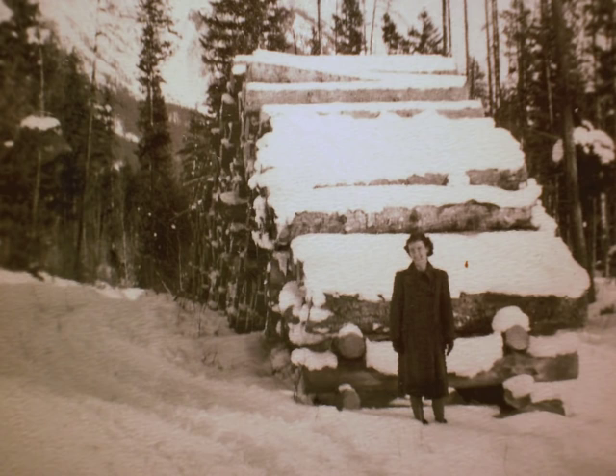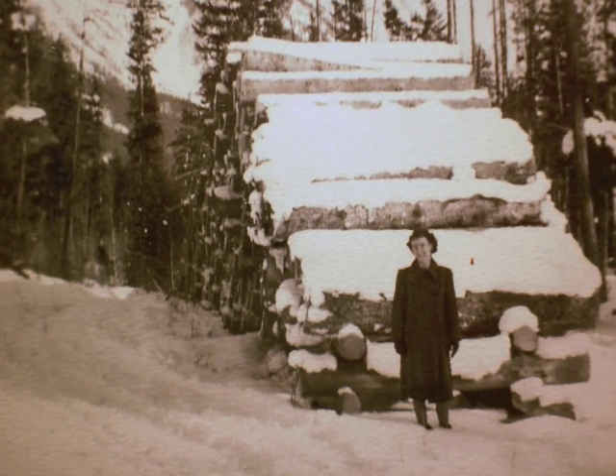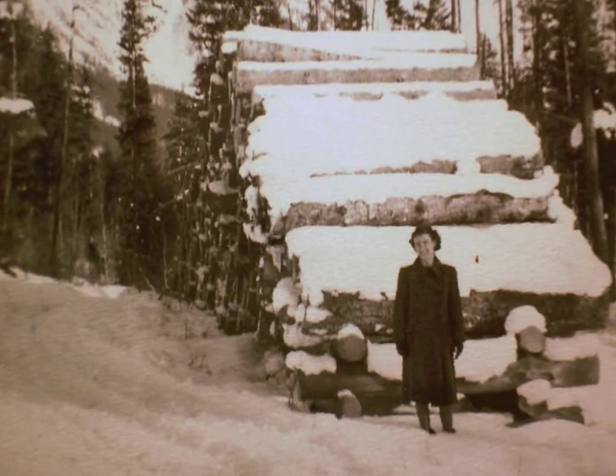But these are tie blocks, and I cut them with a swede saw. Because the old fellow who had the Kelly Place next door came there when I was very young from Alberta. He had a nice big swede saw with a steel frame. One man with a crosscut saw is murdered — you don't get anywhere. But that swede saw would cut like a razor. The one thing is you always had to have a spare, because you'd break the blade so easily, and then you'd have to sharpen it again. The blade was four feet long — so you'd cut these all with it.